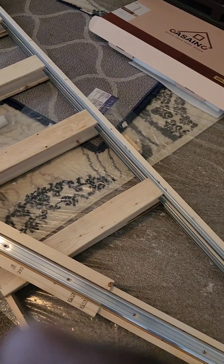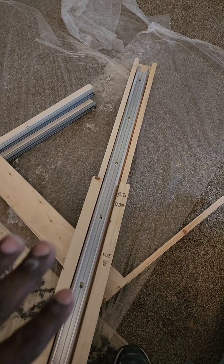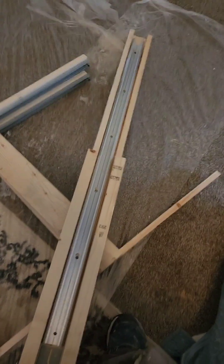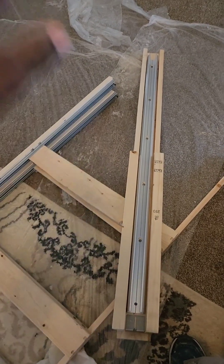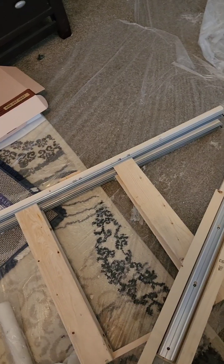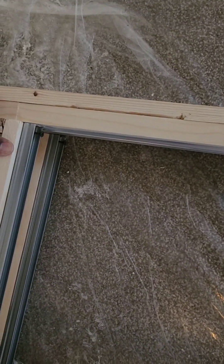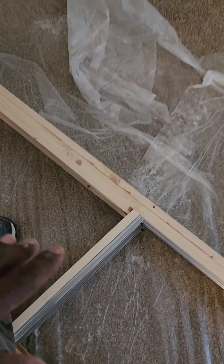This is the most important part — making sure you have the rail facing the right way. On the side where you see the two extra pieces of one-by wood, that goes on the side of the wall where the door will slide into it. That is key. This part over here where you see the whole frame — this is gonna be inside your wall, nobody's gonna see this part. That's the empty side. So my door slides out that way, and to get the frame on I'm going to put it so that the two extra pieces are on the outside.